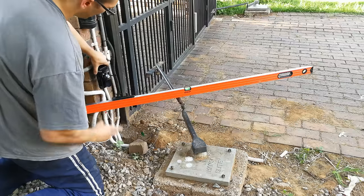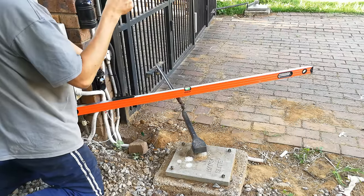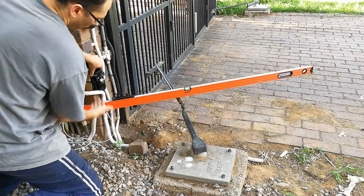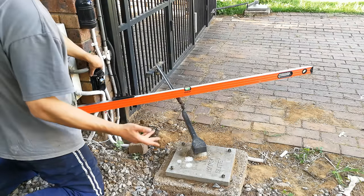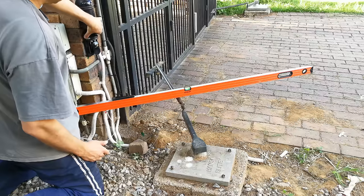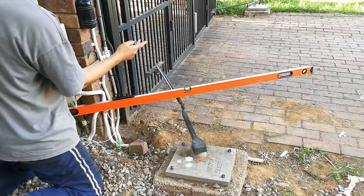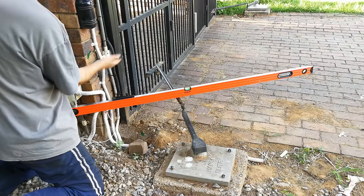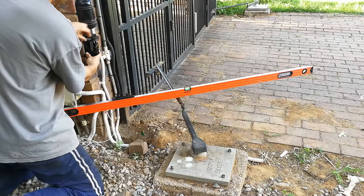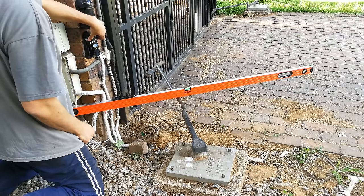At the moment the beam would sit at the current reference point. I showed you those green insulation tapes on the wall, and you can see this side is too low. We've got a large dog that would set it off, so ideally I'd like it higher — but not too high. The reference point was already at half a meter, so I'm going to set it 30 centimeters higher than where it was on that wall.